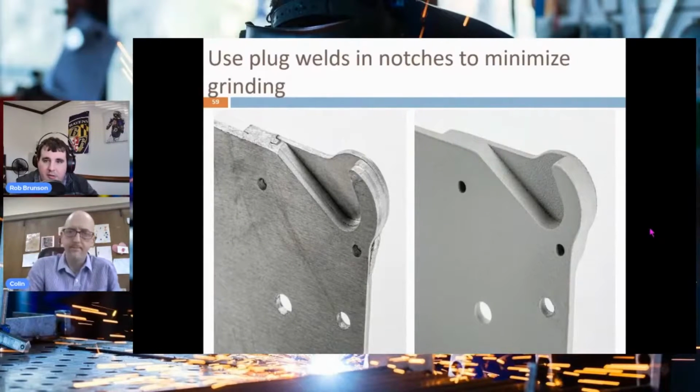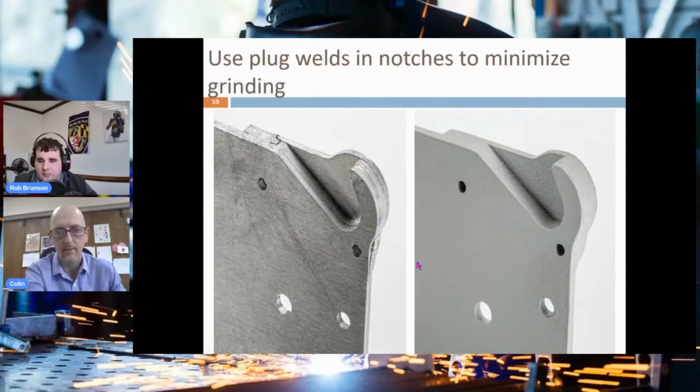Another different part again is a fun product where, again, it's hard to tell on here, but you can see a little bit that you've got three parts that end up welding together. You've got three parts stacked together here. I've actually incorporated the weld bead into the inside. So for the part that's sandwiched in between the two others, we put a relief in there, and the weld is inside that relief. Gotcha. And so it vanishes once it's painted, completely disappears. It's a really fun design. Yeah, you can see how it's stacked together here a little bit. Yep. Neat.